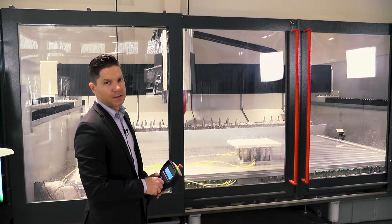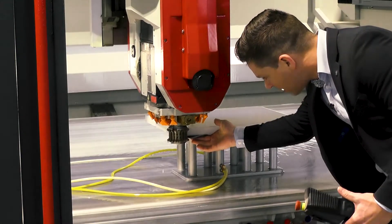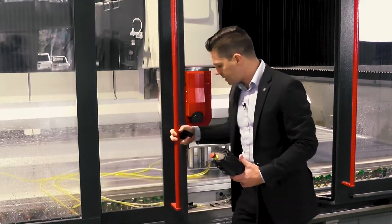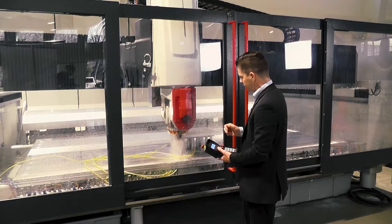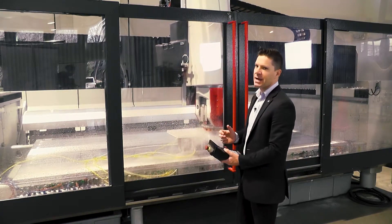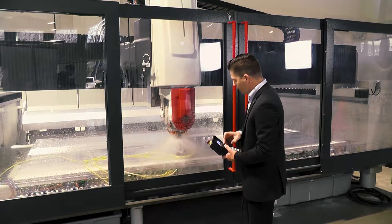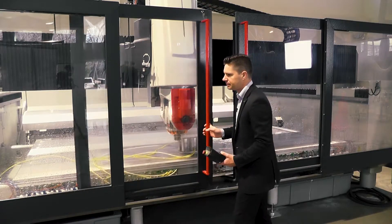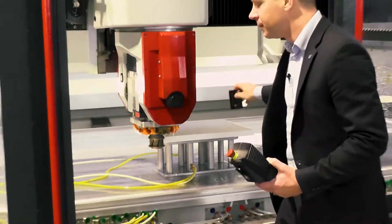Next is the first position profiled T33 R3. I'll slowly bring it in until it makes contact. If it's seating into the profile on both top and bottom, I know the setup is good. Feed rate back to zero, press start, let the tool come to full rotation, then increase feed rate to 100%. We do the same for position two, which runs at 500 inches a minute, so we slow it down at the very front before increasing the feed rate. I'm making sure the lineup puts the diamond in contact on both top and bottom.